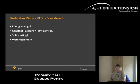And also it prevents water hammer. Water hammer is when you first kick it on, your pipe just slams, because it's bringing water so fast down that line. What that can do is break pipelines, and you can start doing many different kinds of damage.